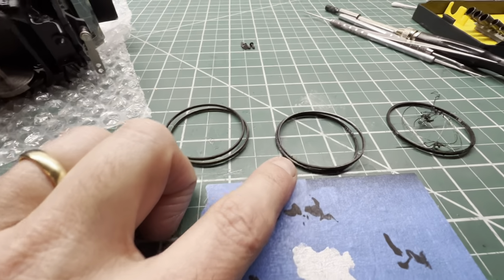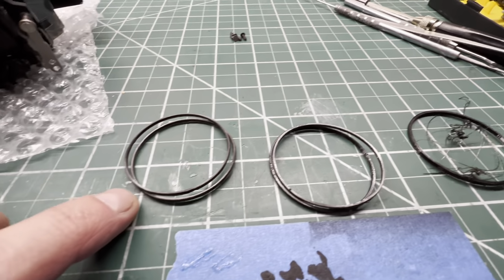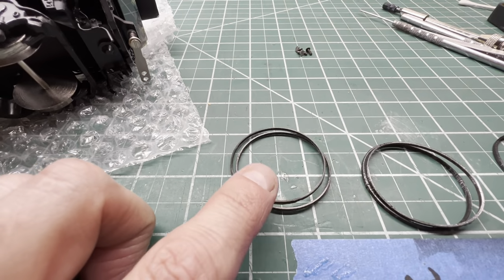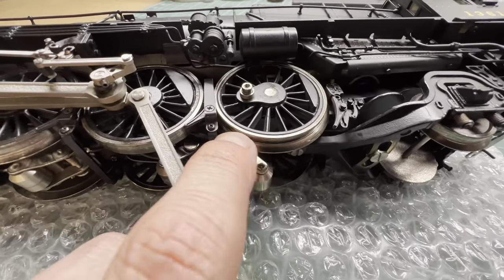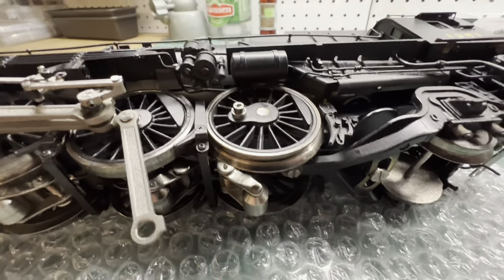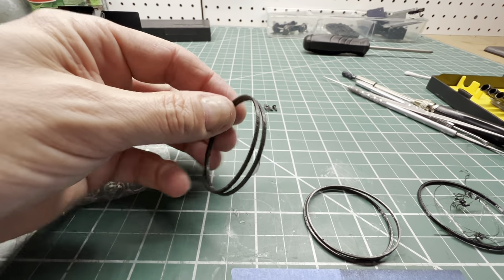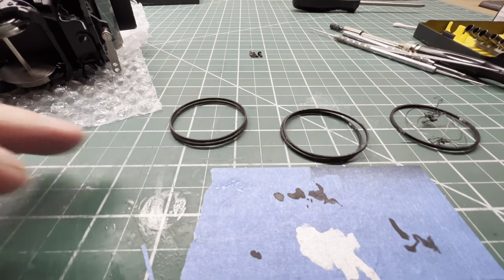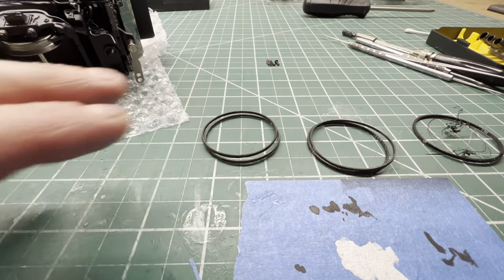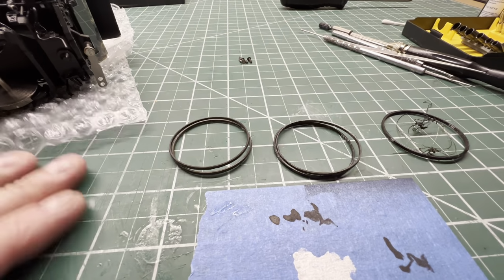But I decided I was going to try to get some more traction out of it, so I made a slightly thicker set. I believe these are like 42.5 millimeters outside diameter and probably like 40 inside diameter. That's the inside diameter of this channel here. And these tires are very thin. You can't always get these from Scott at Third Rail. So I just decided, what the heck, for $20, I'll try some TPU. And if I'm successful, I don't have to bug anybody for traction tires again.